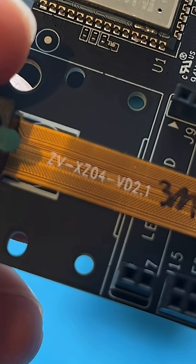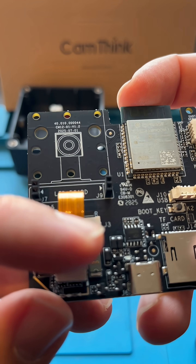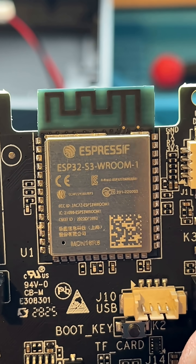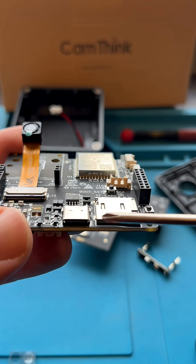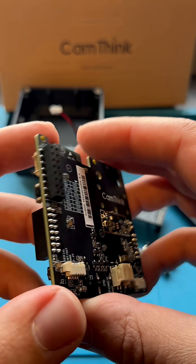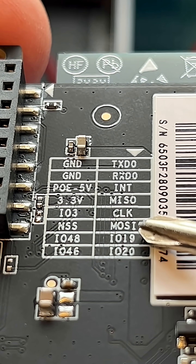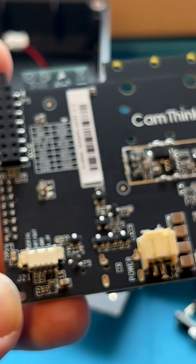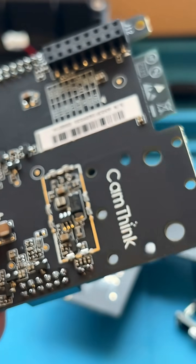The main camera sensor is a 5-megapixel OV5640 and everything is controlled by an ESP32-S3 microcontroller. The NE101 has a 16-pin expansion connector through which you can attach I2C, SPI, UART, and other GPIO devices — for example, PIR motion sensors or temperature sensors.